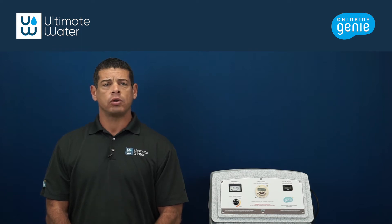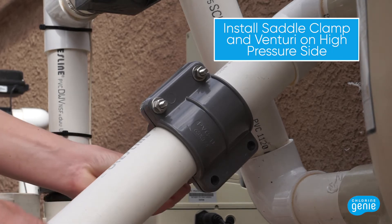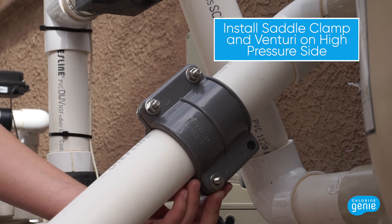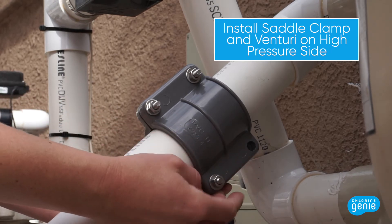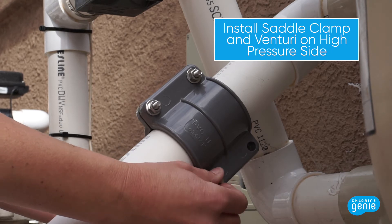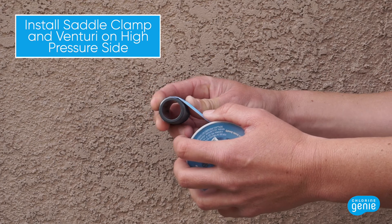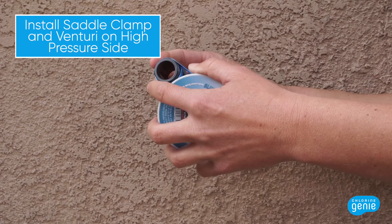At the site of the drilled hole, deburr and remove any residue. Place the rubber O-ring that comes with the saddle clamp inside the clamp around the opening. Then attach the saddle clamp to the pipe using the nuts, bolts, and washers that are included with the saddle clamp kit. Washers must be placed under each bolt head and each nut to avoid damage to the saddle. Check the saddle clamp to determine which size wrench is called for.